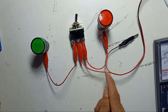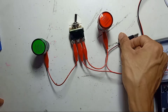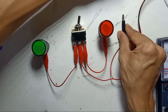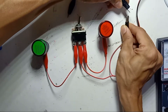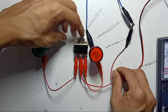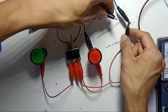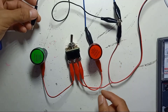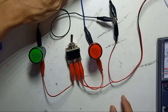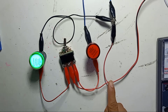So it's very simple and clear: positive wire goes to common, another positive wire out to one loop, then another positive wire out to the other loop. The negative wire connects directly to the negative of the first lamp, and all other negatives connect to the other lamp's negative as well. Wiring is complete. I'm going to turn on my 12-volt power supply.